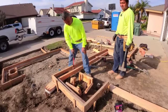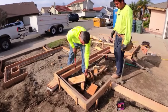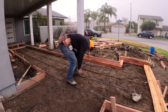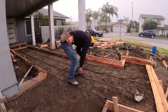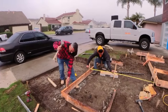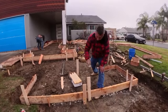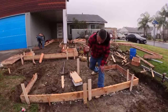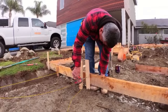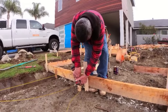What we did was put an inch and a half angle iron in there, and the general contractor welded a 45-degree angle on it to grab onto the concrete. When we strip the forms, the angle iron is at the bottom of the cantilever. The magnetic strip LED lights just go underneath it and they cover all three corners — each side and the front. They just snap together and stick up. I'll go back and refilm it when it's all done with the landscaping and lights.